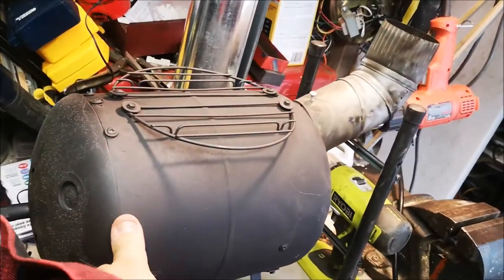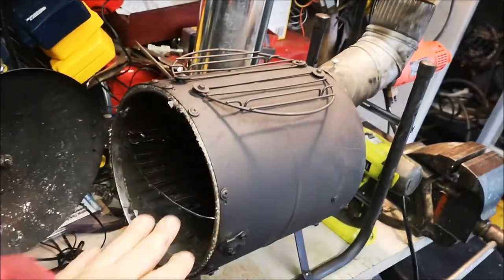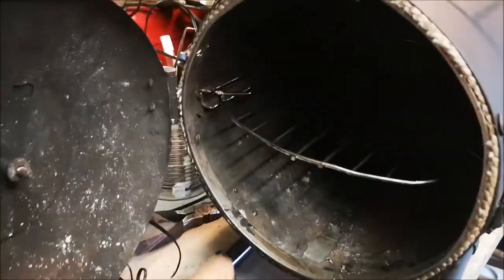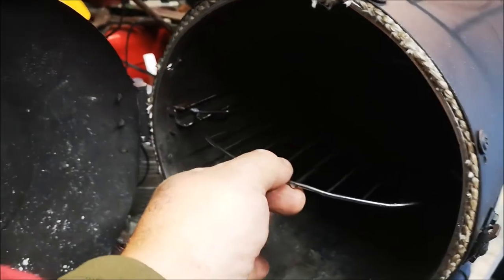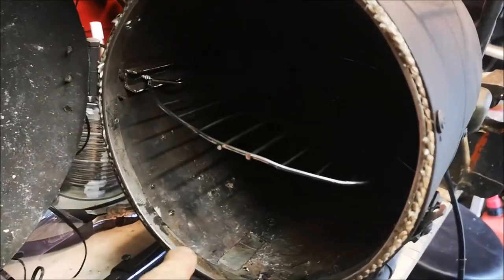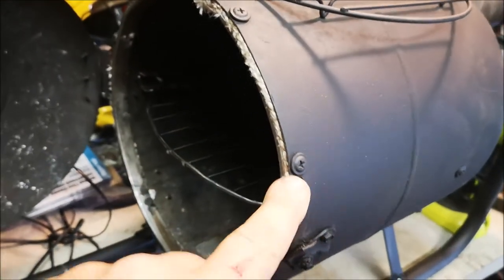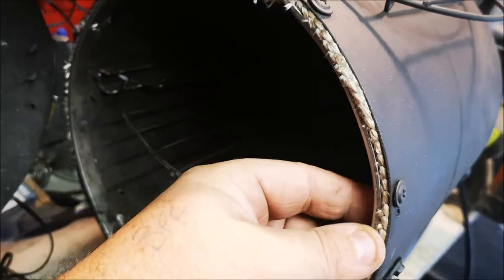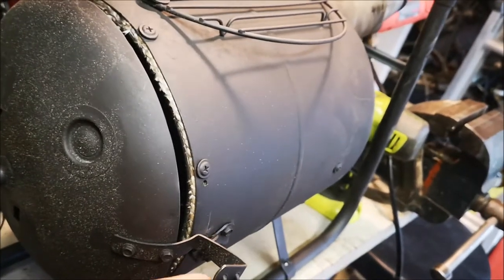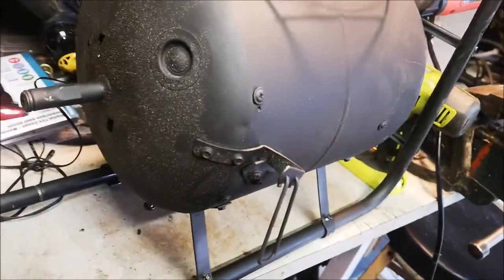I'll provide the link but this is my hot tent stove made out of an old helium tank for filling party balloons. Some modifications I did: I put a shelf bracket along the sides to hold and mount the grate, I put half-inch steel belting around the inside screwed in and sandwiched in stove rope gasket so when it closes it makes a much better seal. I also added a little extension on the handle to make it easier to handle.